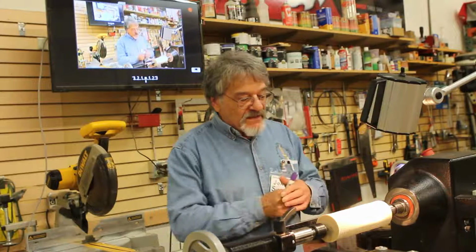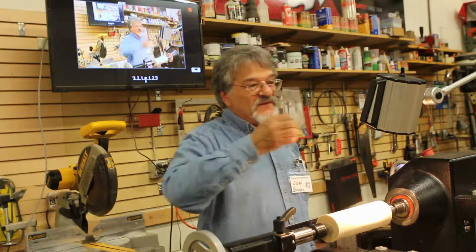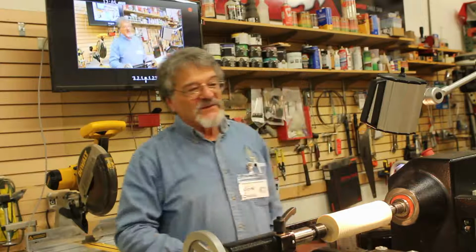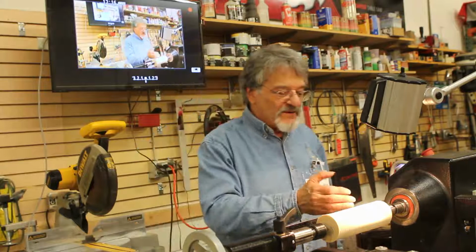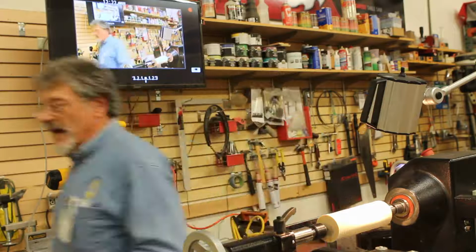This distance here, this quarter inch, that's called the feed. Right? What is a feed? If you've ever done any metal turning, Jim, you know what feed is. So feed is how far the tool moves per revolution of the workpiece. It's really important in metal turning. But in wood turning too, what I have here is a shallow depth and a rapid feed. And that's the most efficient way to rough it. Okay.